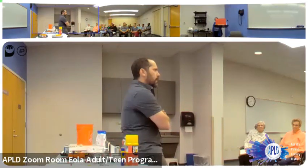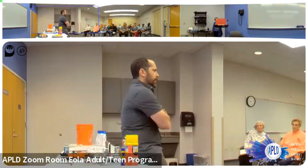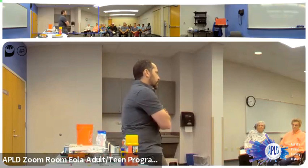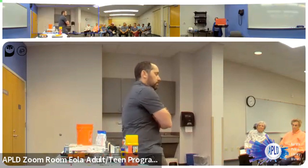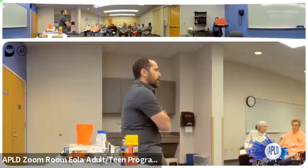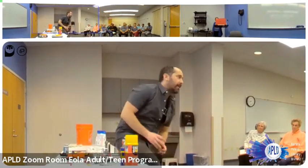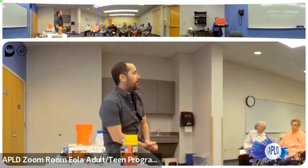I would not recommend your cheapest basic latex paint. But you go to the paint store, you tell them the surface you're painting, whether it's brick or block or poured concrete, and nice and shiny or not so shiny, and you might have to prime it first. Nothing wrong with painting that. And if you're not trying to block moisture, anything will work. But if you are blocking moisture, you have to use what it says that it's going to do. They make paintable products that are designed to block moisture in basements.